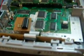Finally, these two chips here, I had to desolder 2 legs off the chips, and rewire them to go to the microcontroller. So depending on whether we put a logic 0 or a logic 1 on these 2 chips here will depend on whether we select 50Hz mode or 60Hz mode. And as far as the reset goes, if the reset was putting out a logic 0, it means we're not resetting. If it puts out a logic 1, it means we're resetting. So it's really quite simple.